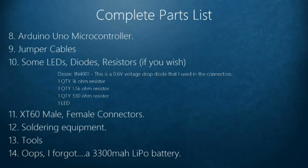The battery I'm using is a 3-cell 3,300 milliamp-hour LiPo. With the 9 by 4.3 prop size, it should give me roughly 15 to 18 minutes of flight time, which is pretty good.